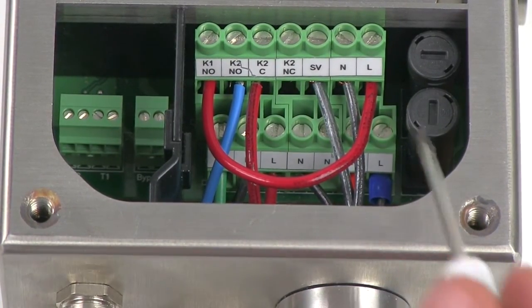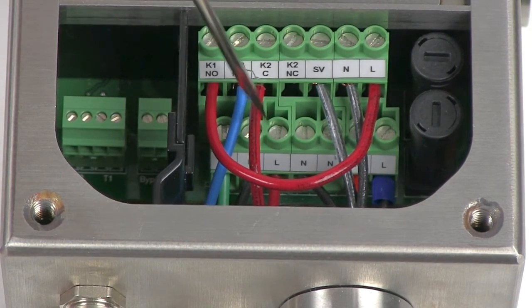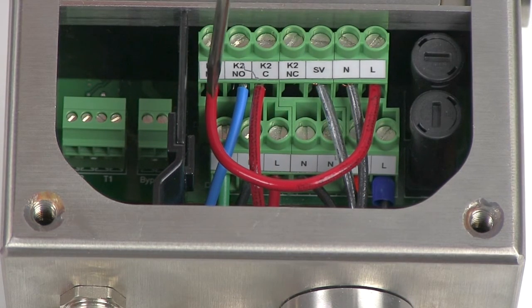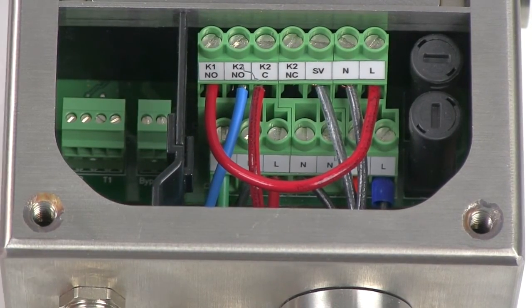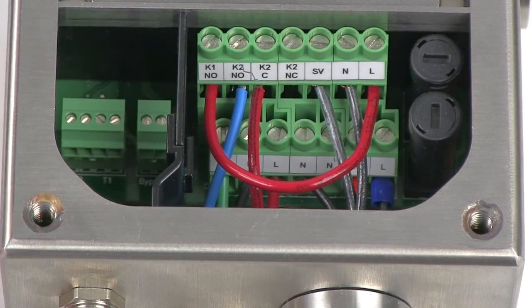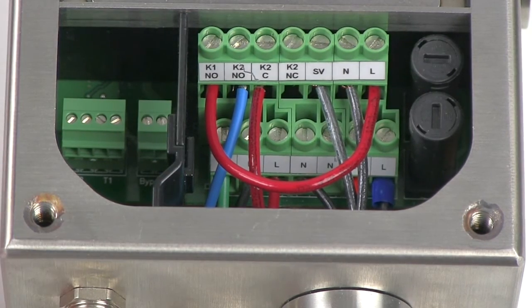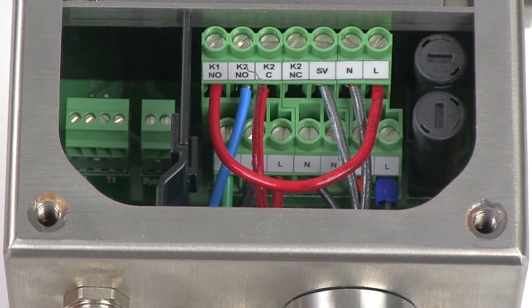What I've just done is added these two red jumper wires. We have an L terminal on the bottom — I was providing power from this L terminal up to our alarm common, so now our alarm is energized. I also jumped the enclosure power over to this L terminal, which now allows me to provide power to our enclosure. Another way to do this connection: you can bring in a different power source. If you don't want to jumper to the power you're providing to the unit, you would just wire in whatever power you want going to your system to the K1 terminal. Once you go through your purging cycle, the K1 contacts close, providing that power to your enclosure.